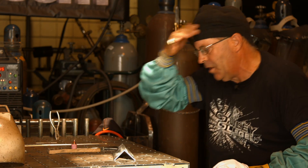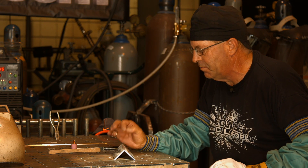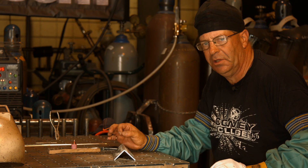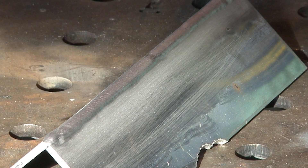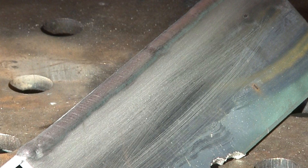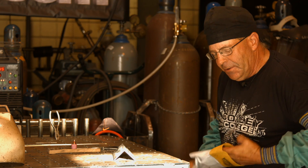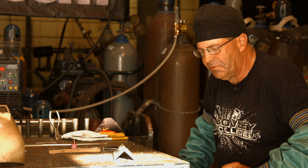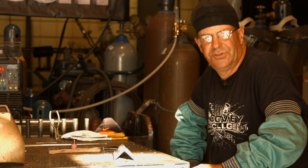This was an experiment for me and I hope it helped — I learned a little bit for sure. You can turn this over and do the fillet part of it. Thin aluminum is possible with DC helium, you just have to watch your heat — it's real easy to blow it up. I started way too hot on this end. If finishing a project, you'd buff it off, sand it, make it look pretty. I hope this answers the viewer question about thinner aluminum on DC helium. Thanks for watching Weld.com — please subscribe!